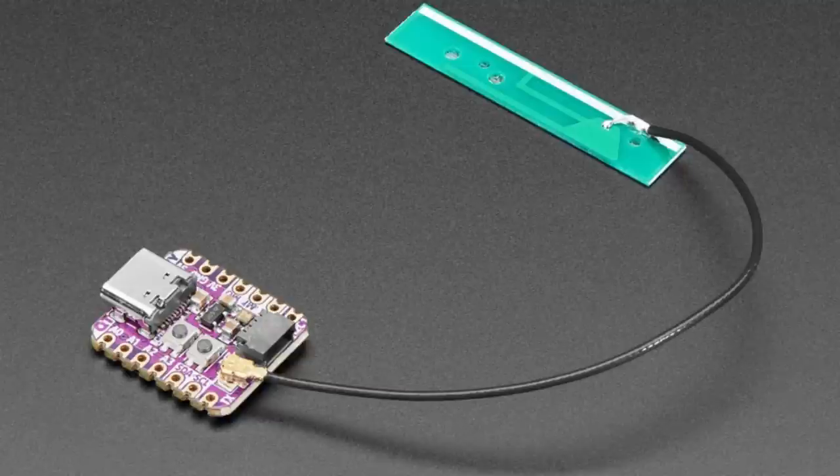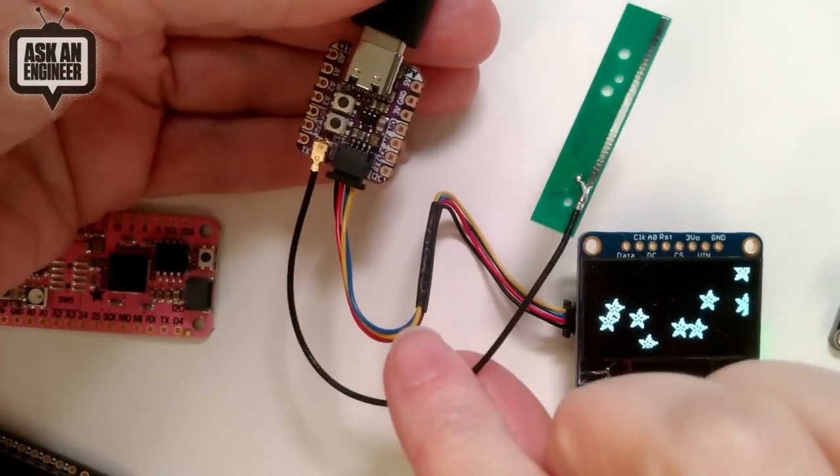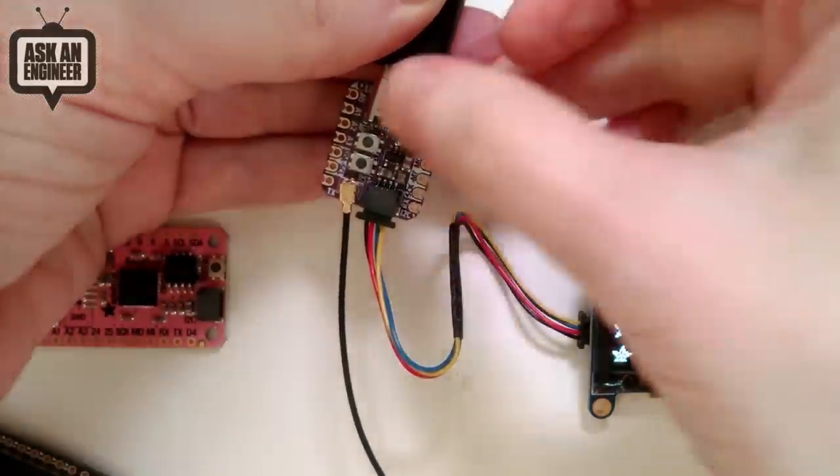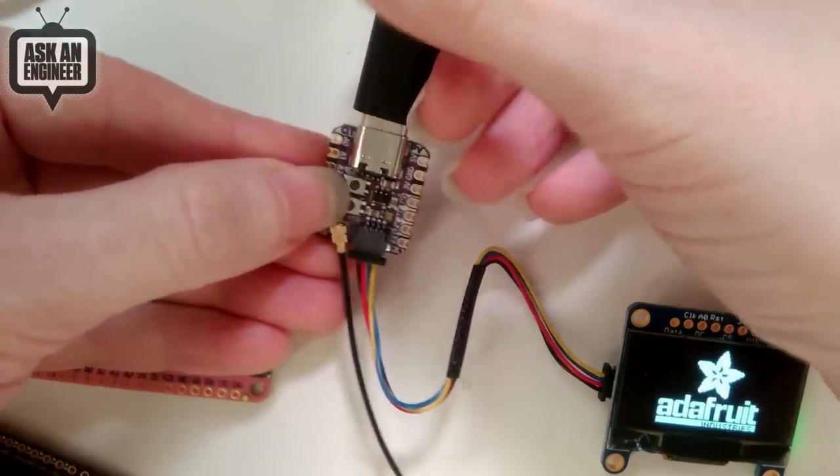In this case there's just a simple wire UFL antenna, but you can also use a UFL-to-RP-SMA adapter and then use an off-the-shelf Wi-Fi antenna. Make sure you get a UFL-to-RP-SMA — do NOT use a UFL-to-SMA connector, because that will not actually connect the signal through. Wi-Fi antennas use a different standard. If you use the wrong one, you'll get no signal. Here on the overhead you can see what it looks like with the antenna connected — you've got the reset and boot buttons, and a NeoPixel blinking fast in purple.